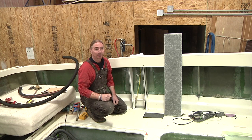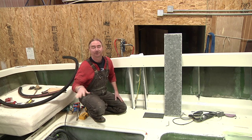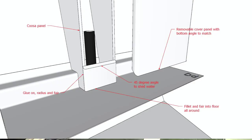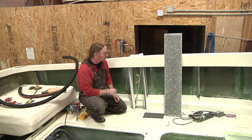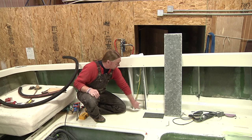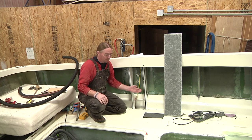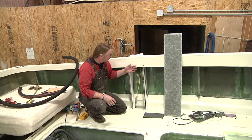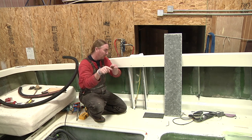There was one email from David D. — I won't say the last name — and he actually put together a SketchUp file for me. I looked at it and thought: you've got to be kidding me, this is so simple but it's perfect, just absolutely perfect. One detail David marked on there, which is a great idea, is on the top of the bottom kick plate — I'll call it a kick plate — to have that as a beveled angle. Maybe 45 degrees is a bit steep, but the logic is that when the main panel is in place and water comes down to this kick plate, it's already angled, so there's no way water can trickle in. These side panels aren't epoxied in yet, but I wanted to dry fit everything including the door to make sure it all works. Then I'll pull everything apart, epoxy it, do my glassing and tabbing where needed.